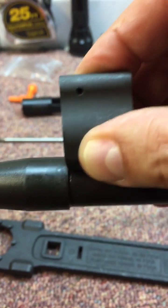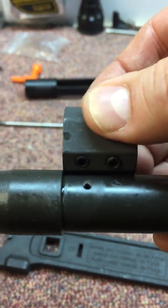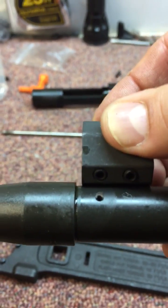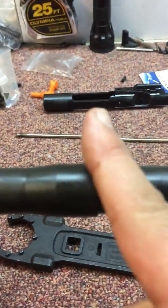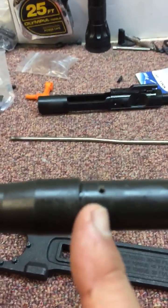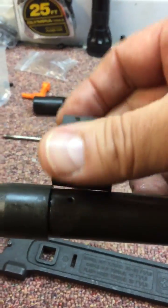So not always do you butt it up against that shoulder. Sometimes you have to check it and space it back a little bit. If you don't position it correctly, you'll be cutting off the pressure to that hole because the holes don't align, causing short cycle or non-cycling problems. So remember, line up your gas blocks correctly. Thanks a lot, see you later.